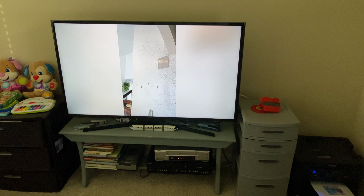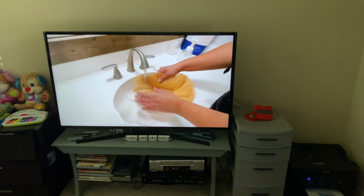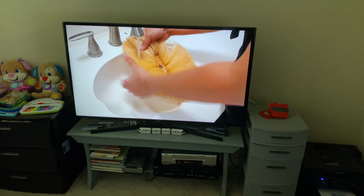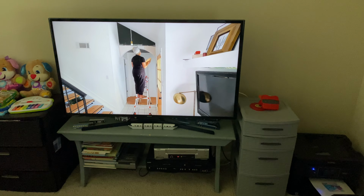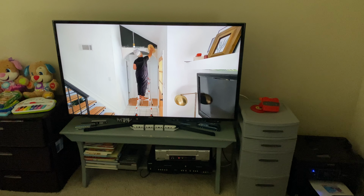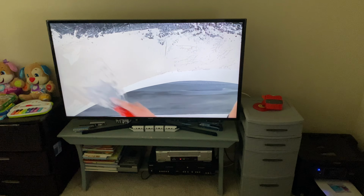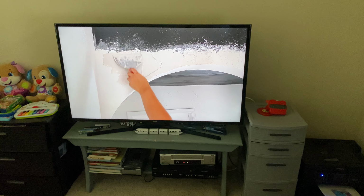We removed the outdated smoke detector, and then I used a patch to patch up the wall. In our home, we have some serious wall texture, and you use this tool to create stomp texture. It's really important to wet it before using it. After many failed attempts of trying to do this texture in our home, I watched a lot of YouTube videos before this attempt. I realized the secret was to make sure that the mud was thin enough and that the brush was really saturated with water before stomping. I applied a really good amount of mud and made sure to get that texture.